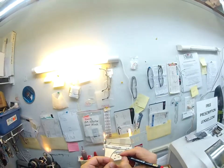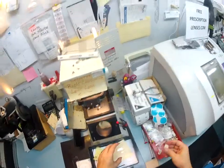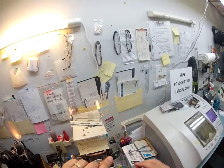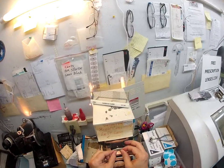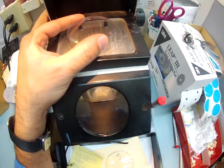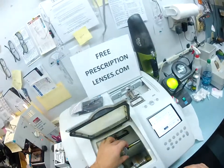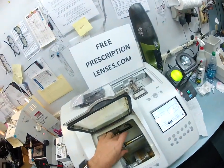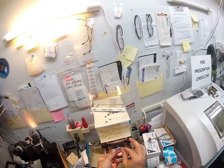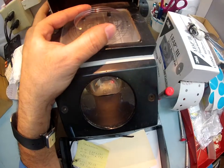Now let's label this L for left. There's a little block that I'm going to put on the lens so it holds in place while it's cutting. I'm going to put the block on there — this is a double-sided adhesive sticker from 3M. The black is the sticky side. I'm going to stick it against the block, pull off the second side, and get everything lined up perfectly. Now in goes your lens. I'm going to close this for now because I like to do everything at the same time. I'm going to do your left lens and put that double-sided adhesive sticker on — pull off one side — and we are good to go.